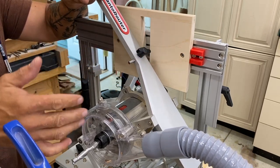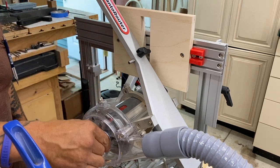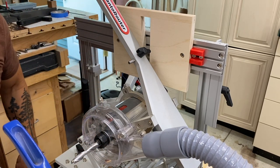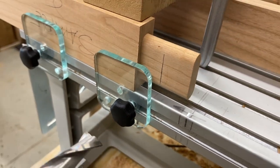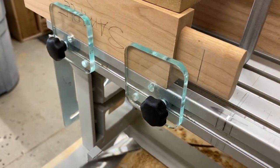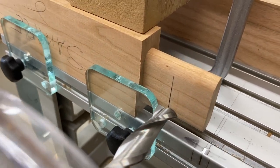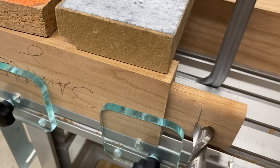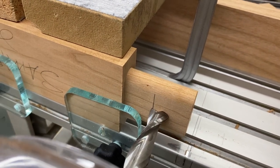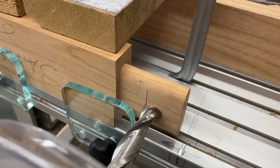Now I'll move the camera angle, and you can see that the router will be cutting right where we want. I'm going to have to handhold to get in there, but there's the mark. You can see the bit comes in. The bit is a little closer to the shoulder — in other words, the line will get cut. That's just about right.